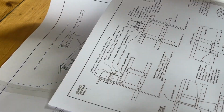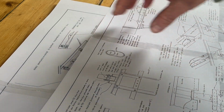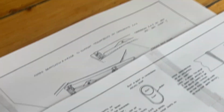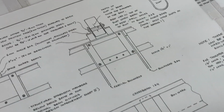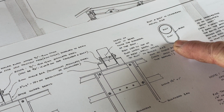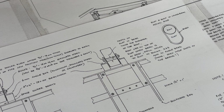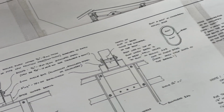It's going to be on a bolt that has a slot that allows the vessel to, let me just give you a better view of this. So there's a slot that carries the beam here, and this is the unique thing about the Wharram design. One of the unique things is that the beams are built to be able to flex and move.